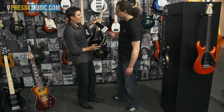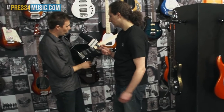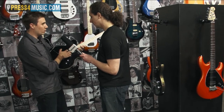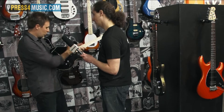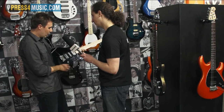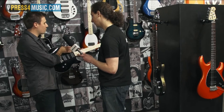Here's just one example — you can literally rewire your guitar. Let's say you have this switch position: you can wire it so this coil can be in series with this coil, parallel with this coil, in series with this coil, parallel with this coil, out of phase — all sorts of different combinations. You can program each of your favorite combinations onto the five switches here. We also have a push-pull pot, so you get five more switch positions, giving you 15 additional tones.